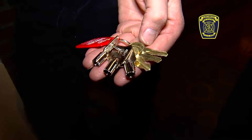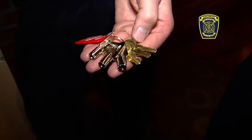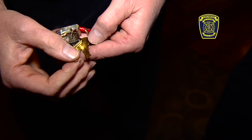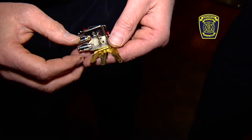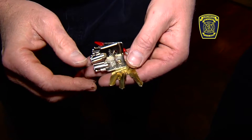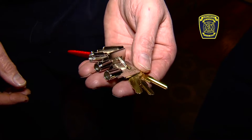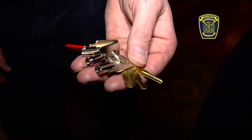There are several different types of elevator keys. Today we're showing a set that has probably the six most popular in the city. Three of them are barrel keys, two are two-sided keys, and there's an older single-sided key that controls different elevators. You need to know the elevators in your running area and what keys they take. It's good to check this during a building inspection or pre-plan. These keys can be kept in the Knox box of the building and available for fire department use in the event of an emergency.